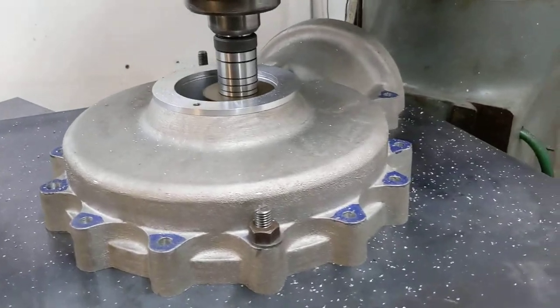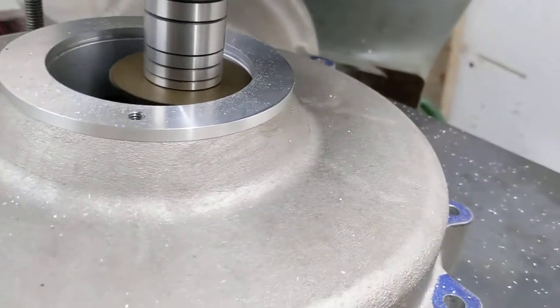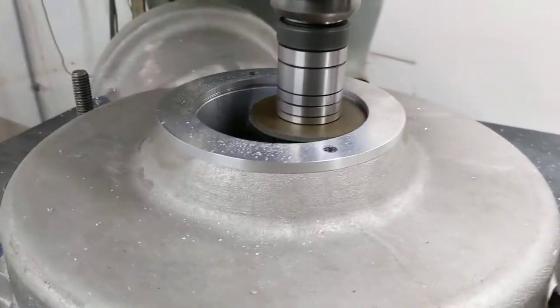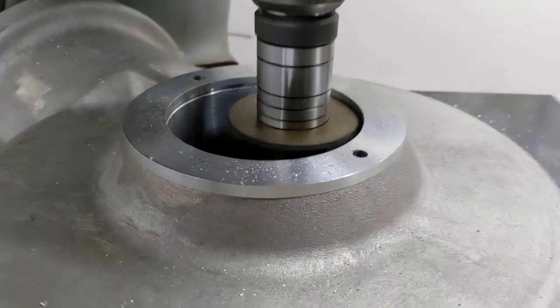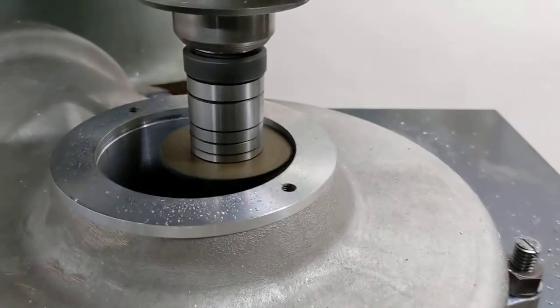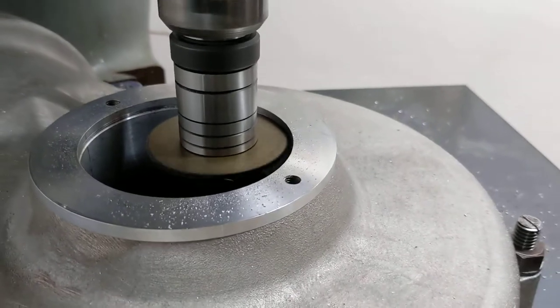The job's been bolted to the plate, the plate's been bolted to the rotary table, the rotary table's been bolted to the mill, and everything's been centred. It's a harder job than you would think to get all that done, because it's difficult to see anything. So you're relying on the clock to tell you that the rotation of the cases is central to the rotation centre of the table.